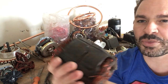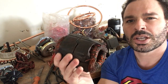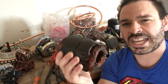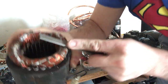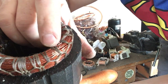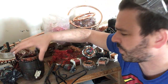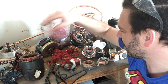These are hit or miss. Some compressors, especially the new models, are aluminum stranded — you'll never know unless you open it. In my opinion, I've done a video on taking these out and it is definitely worth it. And as I can see, if I scratch it again — there you go, that is copper. So this is definitely worth taking apart. It is going to go into my number two. And the nice thing is I'm still going to get the steel from the bottom here, which is still heavy.